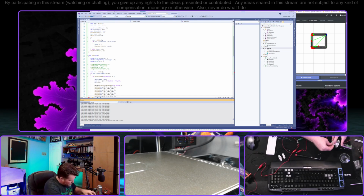All right. Well, actually, I did order screws that I think are the correct size to screw into the motor assembly. I didn't have any. I think they're 1.6 millimeter, and I have 1.4, 1.8, and 2, and none of those fit. So I took a chance and went ahead and ordered those. So at that point, having that snug fit around the motor is less important, because it'll be directly screwed into the top of this part.